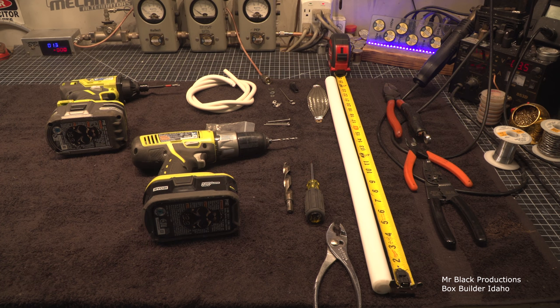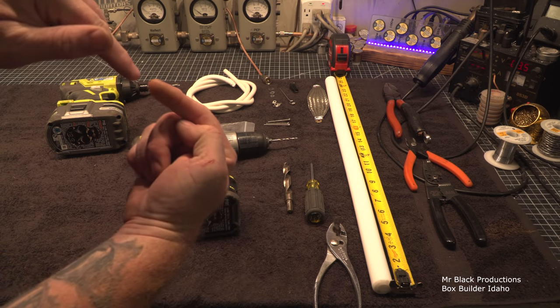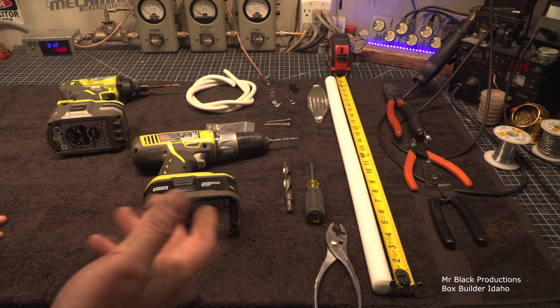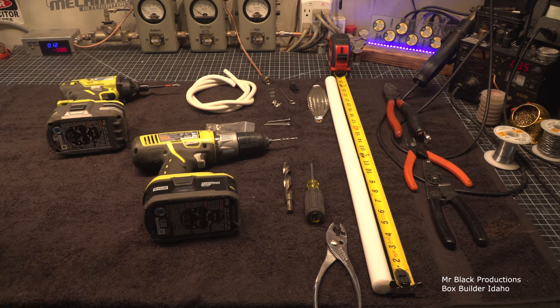And I had to go look this up. Hold on. Ready? Here we go. Teflon. Its electrical resistance is 10 to the 18th power ohms per centimeter. Now, that is on a flat sheet, and we're trying to conduct the high voltage through it. So if you take Mom's cutting board, which is usually nylon, but the high-end ones are Teflon, and you take a 1 centimeter thick piece and try to conduct any voltage through it, that would represent 10 to the 18th power, which works out to be an incredibly stupid number.